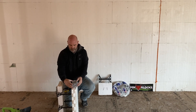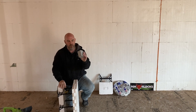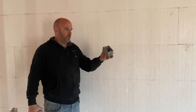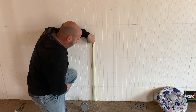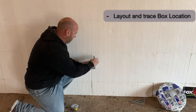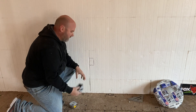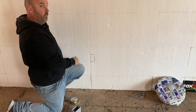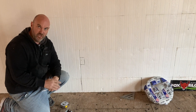We take a regular size box, and when it bottoms out at the concrete, it's sticking out just enough to go through the sheet rock. The sheet rocker, as he's hanging, just cuts around it like he does a traditional box, and it's just embedded in there perfectly. It's really well thought out. What I have here is just a regular electric box, single gang. I pulled the nails out of it — the ones that you normally nail into the studs. So I'm going to measure up off of the floor where we want them to go, and then I'm just going to simply trace it.